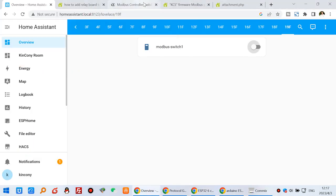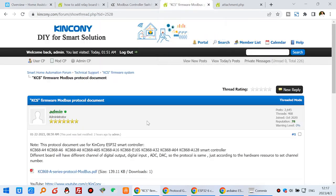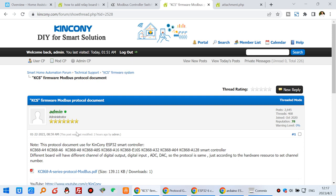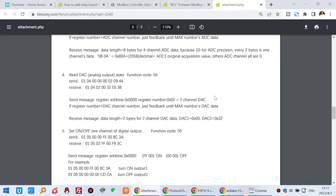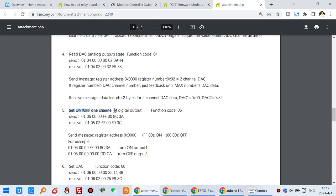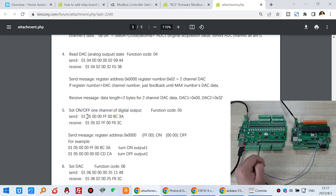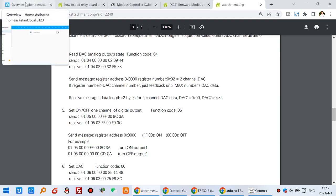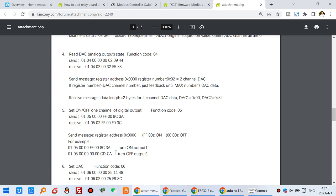For the software, you need to confirm your board has the RS485 Modbus protocol. This is the A6 board — you can find the Modbus protocol document in our forum. If you have your own relay module, you need to know this protocol. I click this protocol and you will find this information. We just need to show you how to control this relay — set on/off for every channel of digital output, just the relay output. This is the command sent to turn on relay 1, and this is to turn off relay 1.